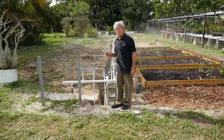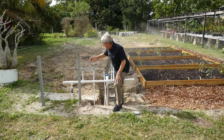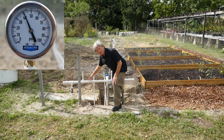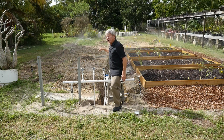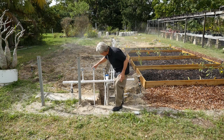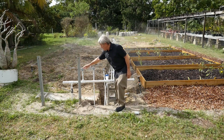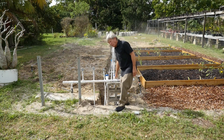To understand and measure the loss of pressure there are three gauges. The first gauge on the left is the upstream gauge, measuring the pressure at the source of water, which is now 40 pounds per square inch. The second gauge measures the pressure at the beginning of the irrigation zone and at the end of the 100-foot supply pipe, currently showing 30 PSI. So there's approximately a 10-pound difference across the 100-foot supply line using the one-inch pipe.